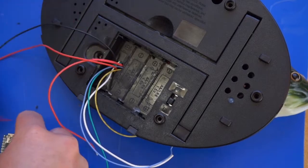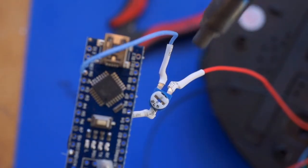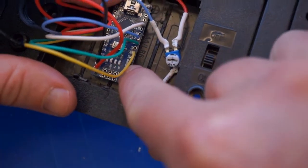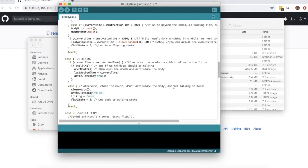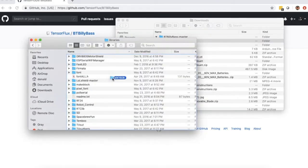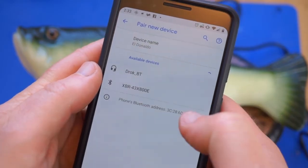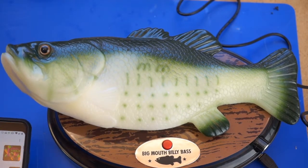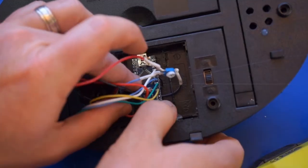The last bit of hardware to install is the Arduino Nano, and we're going to put it here in the battery compartment. The one little extra bit here is to wire in a small 5K potentiometer in line with the wire coming from the Bluetooth module. This gives you a little trim pot for dialing in the sensitivity of the audio before it hits the Arduino, because some Bluetooth devices have wildly different audio levels. Next you need to load up the code I provided onto the Arduino. This code is all new code from Jordan Bunker with comments in each section that spell everything out. There's also a custom library that he created for controlling the H-Bridge board — you'll need to download that library and install it in your Arduino library folder. Once you've successfully uploaded the code and powered everything on, pair your phone with the Bluetooth module and play some test audio to see if everything is working. If your fish is flipping out too much or too little, you can use that trim pot to dial in the setting you like. When you're happy, seal everything back up and then move on to figuring out where Billy is going to live in your house.